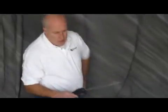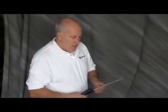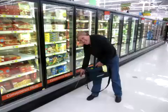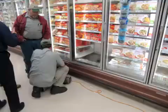We suggest that you walk through the store. If you're walking through the main part of the store and you have a big leak, and you walk in the front door, you may get a one or two PPM reading right in the front of the store. That doesn't mean it's a small leak — it could be a huge leak because it's reading one PPM mixed with all the air in the whole store. As you walk down, your PPM levels will go up as you get closer to the leak.